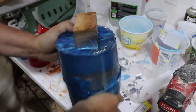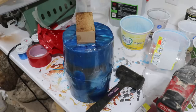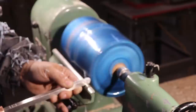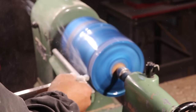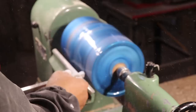It looks like it swirled pretty nicely, and where I poured it right over the wood it's probably going to look different inside than it does on the outside, so I'm anxious to see how that goes. I really wanted to get the mold off before turning because I have the center mark in the tenon on the end underneath. I've got this back between centers and both center marks from when I originally roughed it are still intact, but we dried and stabilized it so the wood's probably moved. All I want to do is remove the resin down to the surface of the burl — if I'm cutting burl on one side and there's excess resin on the other, I'll know it's not aligned and I may have to adjust.